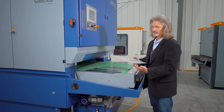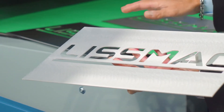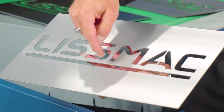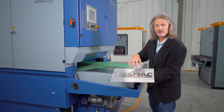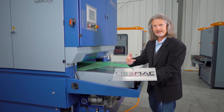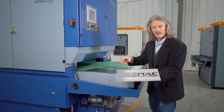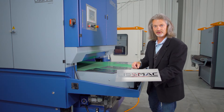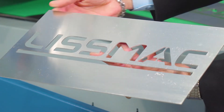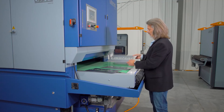This would be an example of a laser-cut aluminum part that has been deburred only. In this example we haven't done the surface finishing — we've done only the deburring — and you can see the difference in the surface because we have some swirl marks. That's an indication that we used only the top brushes of the machine. This would have been done as an RTT configuration: an abrasive belt head followed by a top brush and then another top brush, with both top brush heads going in opposite directions. There is a raw, or 'before,' piece shown as an example of what the part looked like before deburring.